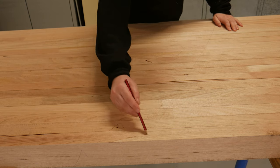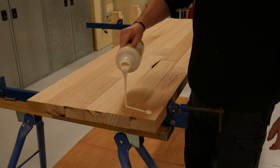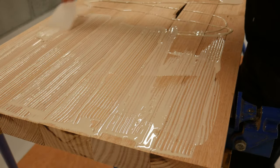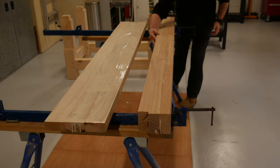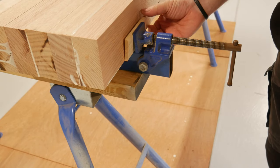For the bench top, the hardwood LVLs were laid out and glued up in three small sections so that they could fit through the thicknesser. A simple plastic scraper with notches filed on the edge has become my go-to glue applicator. Sash clamps and cauls were used to keep the sections as flat as possible during glue-up.